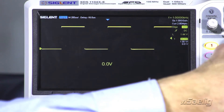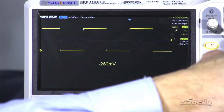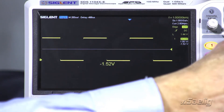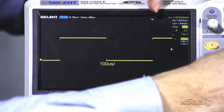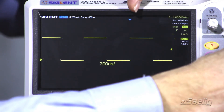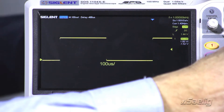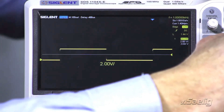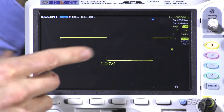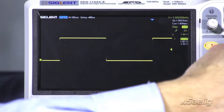Typically when we move off of the center line of the oscilloscope, I'm going to move the horizontal over a little bit and move that vertical down just a little bit. Now when we zoom, you'll see that both the horizontal position, as I change the horizontal scale, will move. We're actually zooming around the center of the display, and the vertical we're going to do the same — you'll see that the vertical position is changing. That is what we call zooming around a fixed position on the scope.